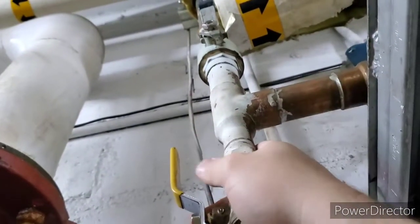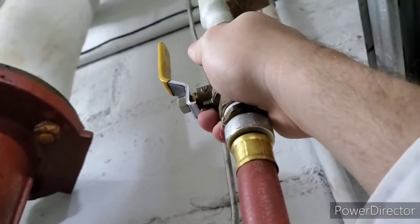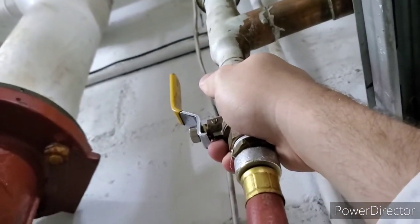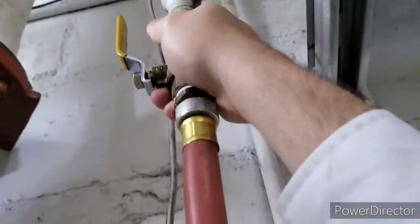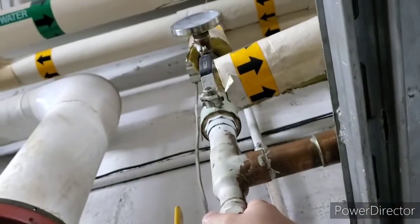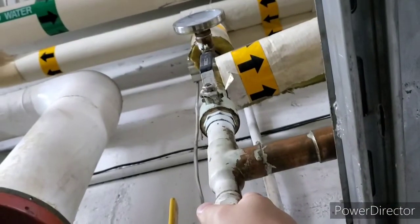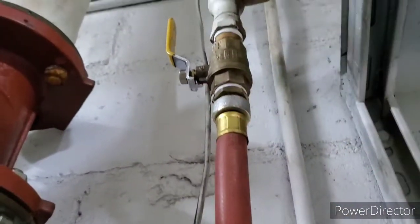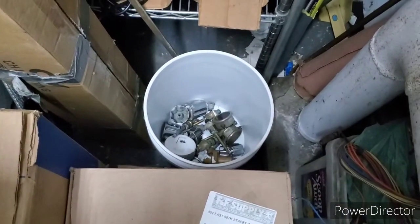This is the return hot water line. What you do is turn off the circulator pump, shut the outlet valve, and then open this one — so this is all the hot water returning, and any air will bleed out through here. We've got to let it go for 30 minutes. There's definitely more air where that came from. We've been staying in here for a while. The old one's broken — here's the new one. No air.